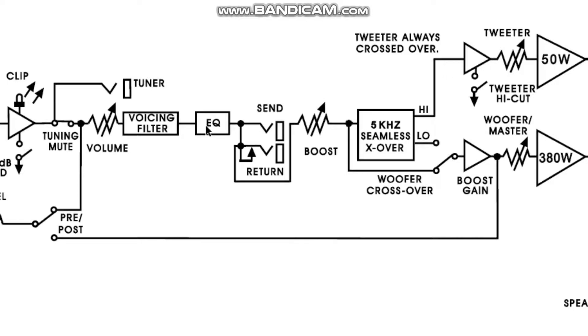What we have here — take a look at this signal — it goes to the send jack, but it also connects to the return jack. This allows us to, for example, plug a jack into the send and run out to perhaps a second amplifier or a mixing board. I can also use this to patch in perhaps an effects device, maybe an equalizer, compressor, or reverb or something like that.